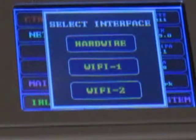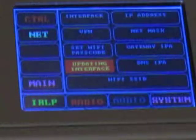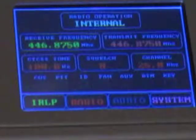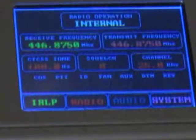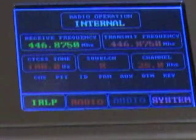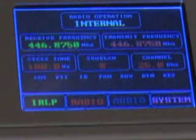That one is a little tricky to set up, so Mark Guyboard helped me, and I'm sure he will help you too, to set up a hotspot with your cell phone and get it to handshake with this thing. But I'm just going to keep it on Wi-Fi 1. Radio — that's where you're setting up the internal UHF two-way radio. So you pick your simplex frequency; I picked 446.875. This is a low range — you can just keep it there. 100 is the PL tone or CTCSS tone. So you could set your walkie-talkie or your mobile radio, and that way when you're walking around your house you've got communication to whatever node you're connected to.